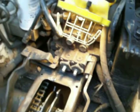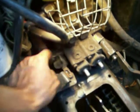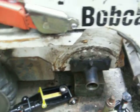I think I will do one for the back when I do my back ones, but I got to take this pump out, and maybe the hydrostatic. We'll see. The hydrostatic here, gotta take it out. I took it out before. I got a video on that. And I gotta take this out here, the spools, the whole contraption, and then make a hole in there at the bottom to take out the axle in the back. But for today and for the next month, I think I'm gonna leave the back ones for a little while and just worry about doing the front right now. I think the back ones are okay just for a little bit. But there you go, see?